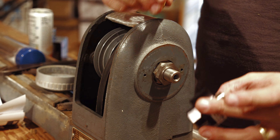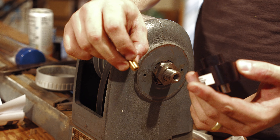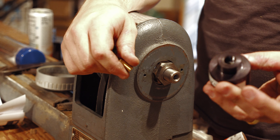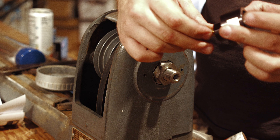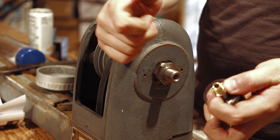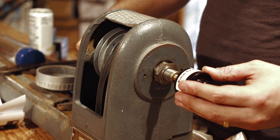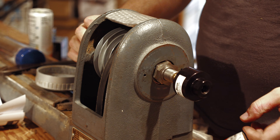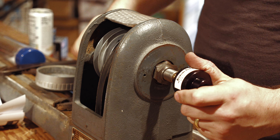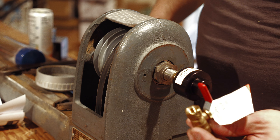I think I'm going to need some additional parts, but I can show you right here how I'm going to use this. I don't think it matters which side they say is inlet and outlet, but I don't think it really matters - it's under pressure and the coupling rotates. Because this little silver end is eighth inch NPT, threaded with my little eighth inch male-to-male, it fits directly with this spindle here. And all of a sudden I've got a rotary coupling. You can see I can hold this stationary and turn my spindle. I have a few other fittings I may use.